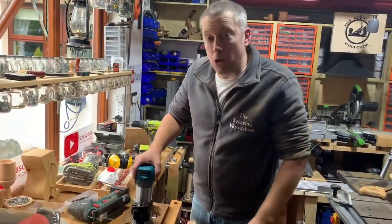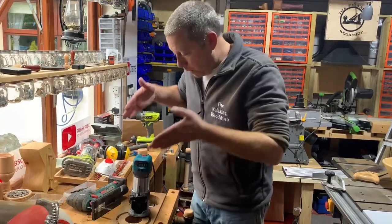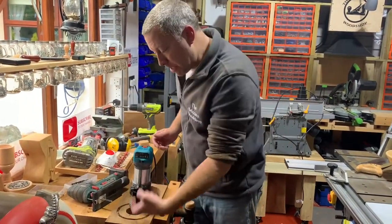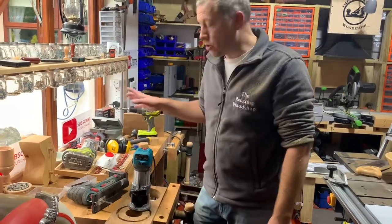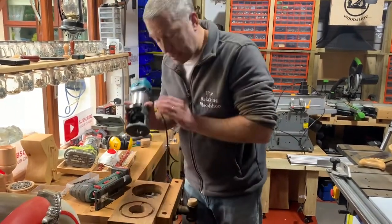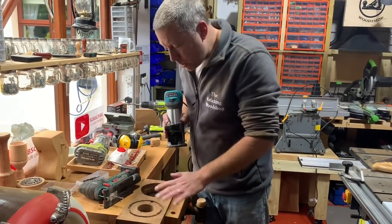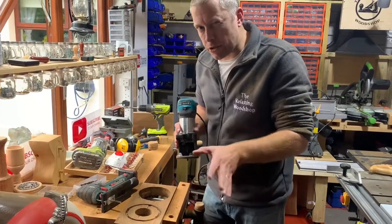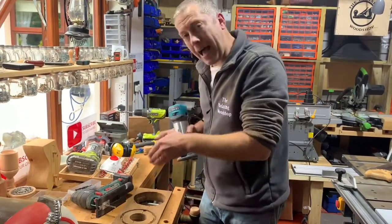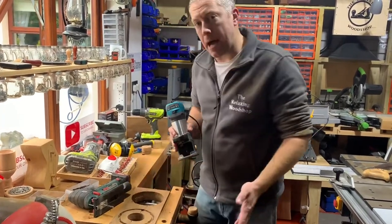So guys, as you know, we like to show all the warts and everything else that goes wrong in here. As I was drilling out the core, which I thought was going to be handy because then it could go through, with this being such a hard wood, my jigsaws were not cutting through it. So what I've had to do is get a straight router bit, go in about 1 to 1.5 centimeters, and then go back out, go in again at 2 centimeters, to get half the depth there, which means the jigsaw will make easier and lighter passes at it.